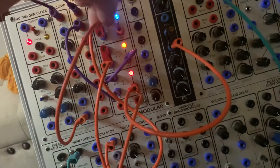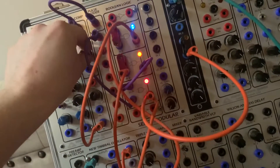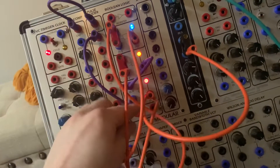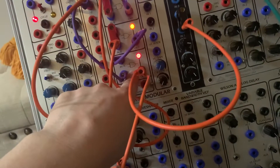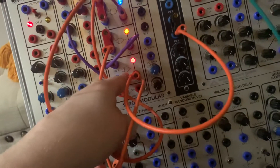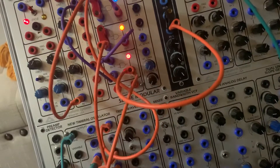The other square wave goes down into the N-com, which is what chooses my divisions. Then the result is divided by two to turn it into a nice square wave, and that goes into the other side of the exclusive OR logic gate. An exclusive OR logic gate can be used as a phase comparator, which is what we need to push a VCO up or down to match the other one.